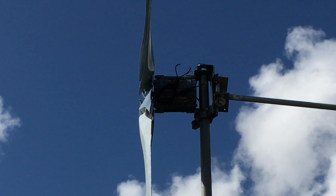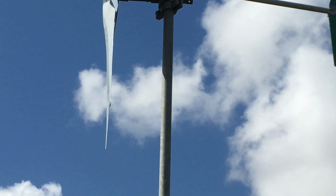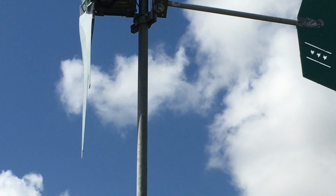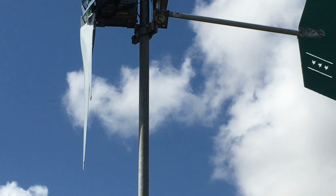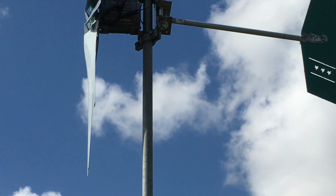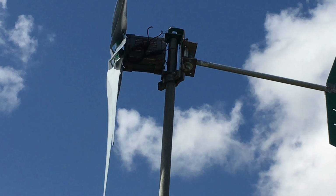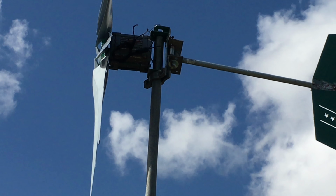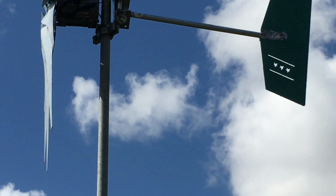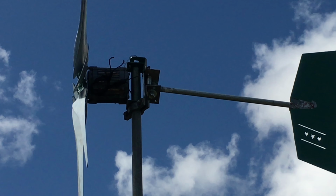The mount is okay, but just a little bit, a little thick of metal behind there. Reinforce the back to put that mount on, to support that kind of tail there. Yeah, I could see that. That's what I would need right now. Some reinforcement, a better design mount. Put it behind there and it will be rocking away steadily.